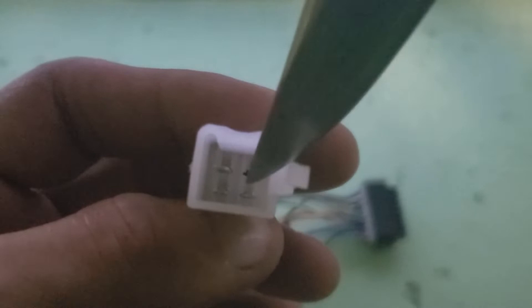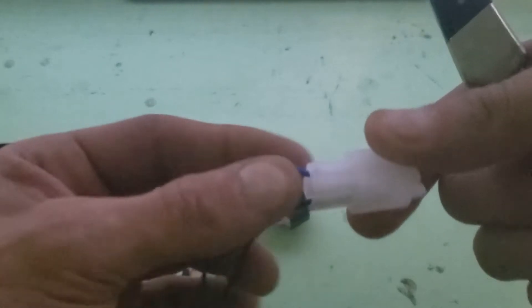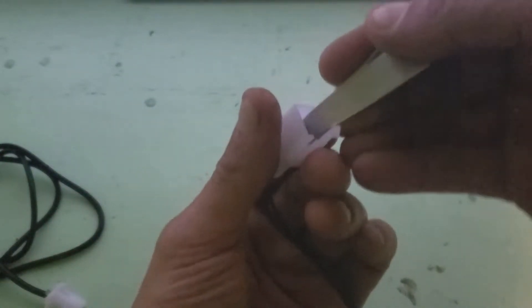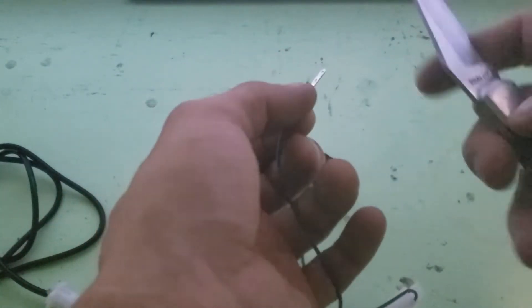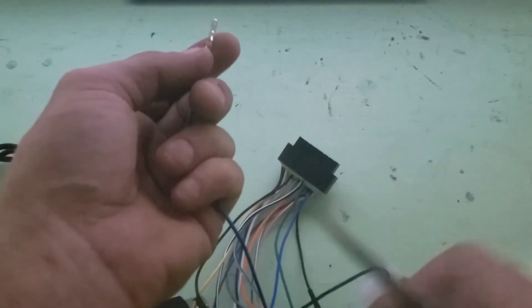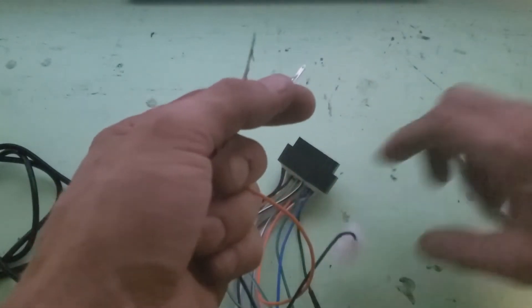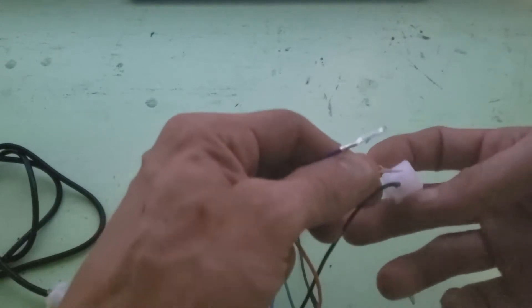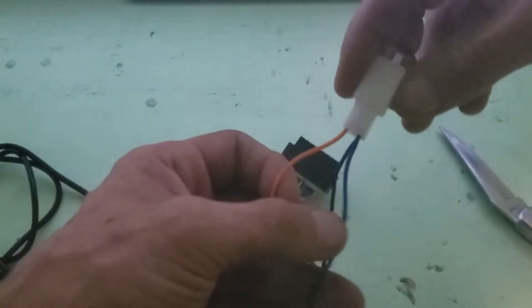You just take something like a knife or a pin and right there you'll see there's these little tabs. You got to push those tabs in and then you can pull the cables out. Push the tabs in, pull the cables out, do it with the other one. Once you've got the wire out, take a knife or something and just push those tabs back out where they were so that it will click back in when you put the wires back in. Make sure to check the orientation — you want to put the orange one where the blue one was and the blue one where the orange one was. And there we go.